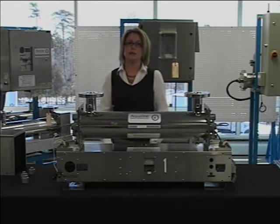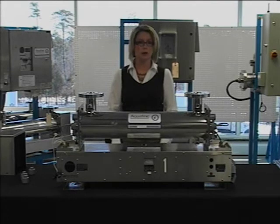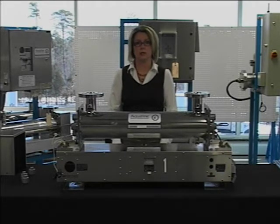With all the quartz sleeves now in place, we are ready to repressurize the system and slowly fill the treatment chamber with water. You'll test your compression nut assembly for any leaks. If there are any leaks found, depressurize the system and tighten the compression nut assembly. Retest until there are no leaks found.